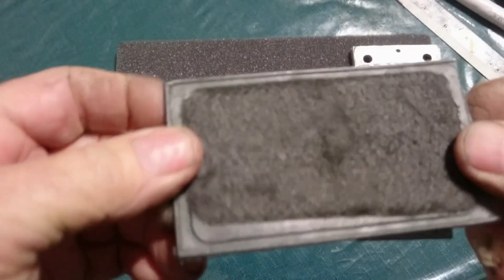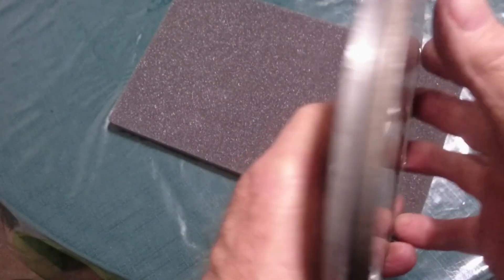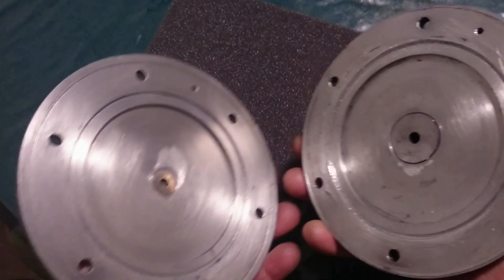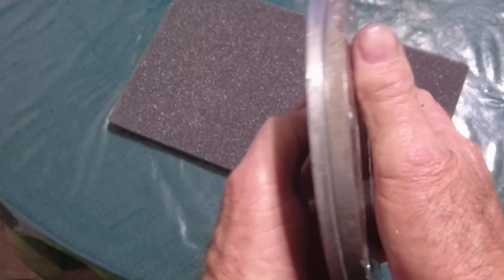It's a separator in my zinc bromide battery for series cells. Here are some round ones I made for use in a PVC pipe — same thing as the square one, just sandwich it in there. What this little plastic separator in the middle of the zinc bromide battery does is: it's HDPE plastic impregnated with carbon felt on either side, heat impregnated into it. It conducts electricity through quite well but blocks liquid, so it's actually like putting two cells in series on top of each other.